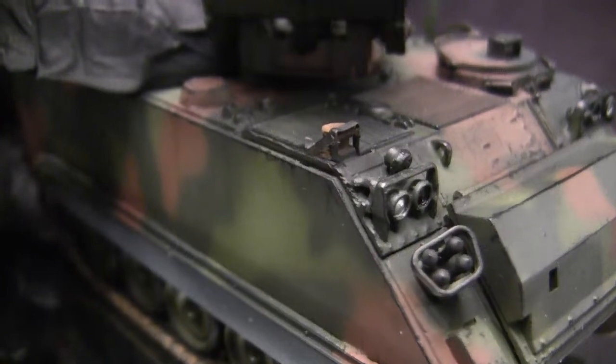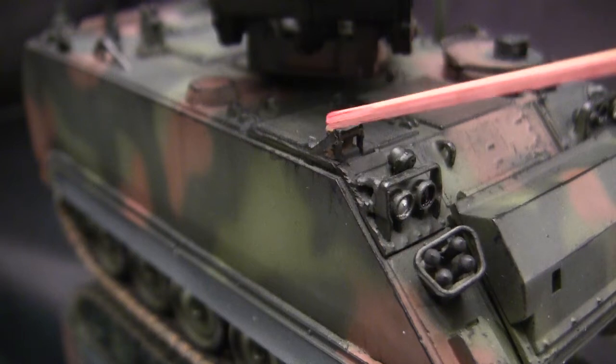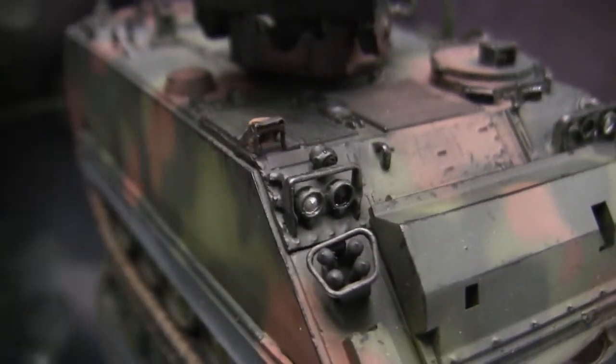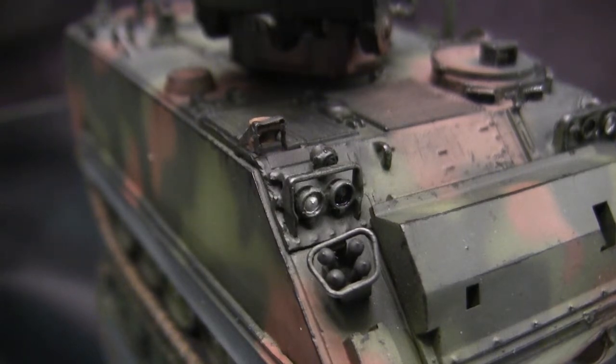While on this area, you can see the brush guard that has been fabricated on the exhaust manifold. This was fabricated out of a strip of thin aluminum. It's basically made from soda can metal, and I carefully cut it to the appropriate thinness and bent it to shape, as well as fabricating the other support struts that you see here. This detailing really fills in the look and looks much better compared to the broken plastic one that we saw at the beginning of the video.